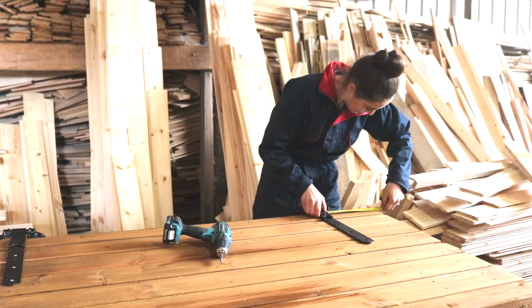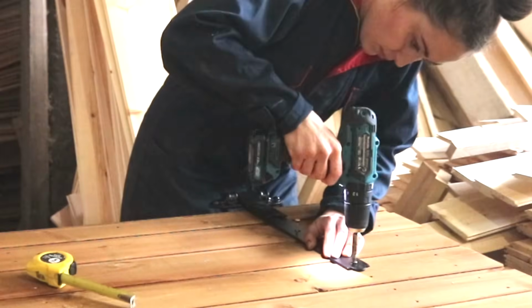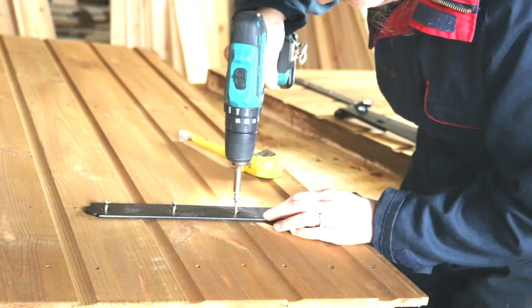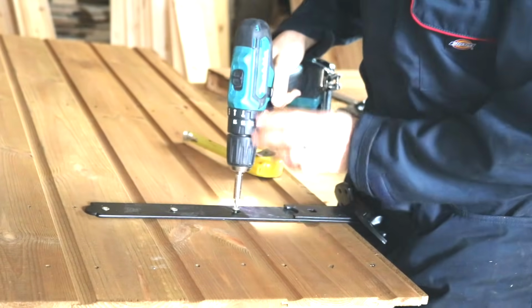So I lined the main body of the hinges to the top and bottom spar and offset the screw mounts by about 5mm. With them being heavy duty, I'm using thicker screws for these, and really I should have been best pre-drilling before screwing. Luckily I got away with no splitting.